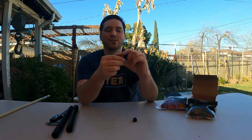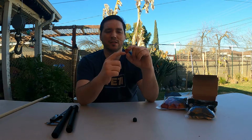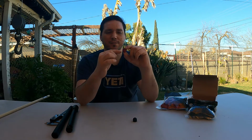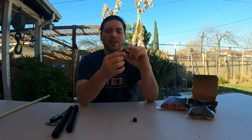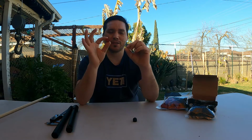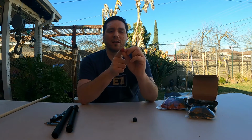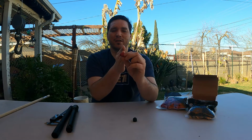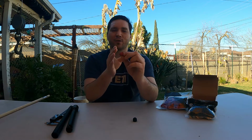And it's gonna allow me to drill down into this with a ball end mill and/or a spherical end mill and create a pocket. And then I could load it up with different weights, okay? So like lead shot, steel, or even bismuth, okay? To create different weights of projectiles. And it will allow me to set that weight on different planes. So I could either go here, here, or all the way forward.